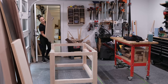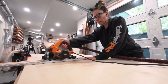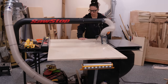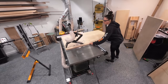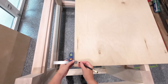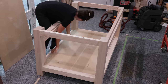Time to build the cabinet. Now that the skeleton of the base is done, I can actually use it to work on, which is really cool. These two pieces of three-quarter inch ply are going to be the bottom and the top of the cabinet, but they won't be the exact same length. I roughly cut them to length so they're easier to manage, then ripped them to width at the table saw — they'll both be the same width. These pieces will rest on the rabbets cut on the aprons, but the corners of the legs get in the way, so they'll need to be notched out. I used a combo square butted up against the leg to get the dimensions of the notches, then cut them away with my favorite tool, the jigsaw. These notches will be hidden inside the cabinet so you're never going to see them if you mess up the cut. Test fit, and we're good.